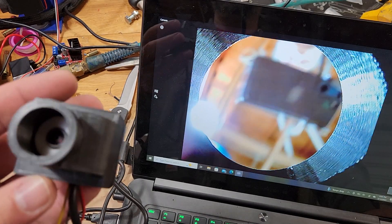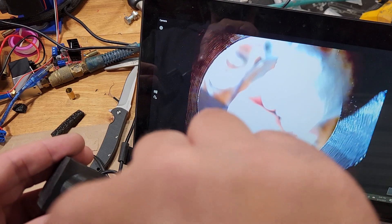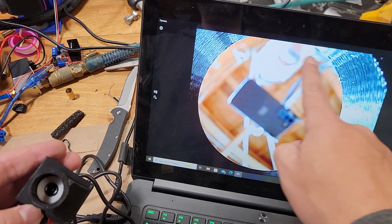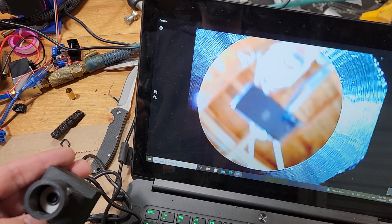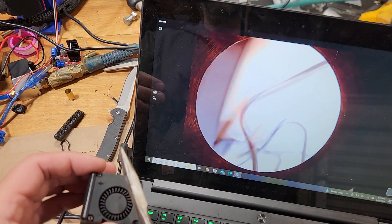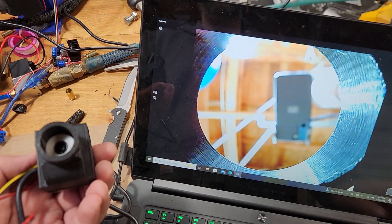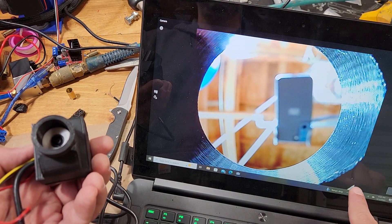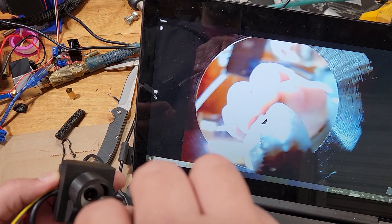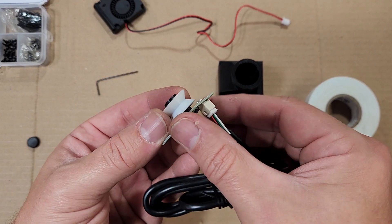Now it's time to hook up the camera and test it out to make sure we're getting a good picture. The first thing I'm going to do is push that ring down and make sure it's seated properly. If we look at our camera image you'll see black all the way around the edges other than some reflections, which will go away. But one thing I want to show you: after a little bit of pounding I'm able to reproduce a little white triangle in the lower right corner — and this is the kind of thing we want to avoid. That white triangle is actually the light ring showing up on the camera.